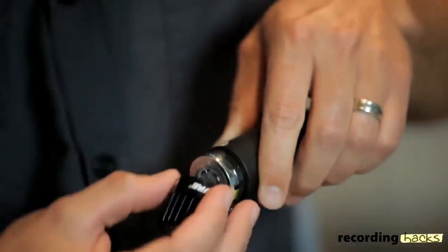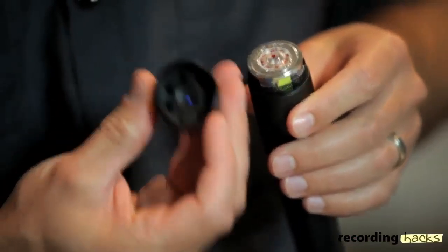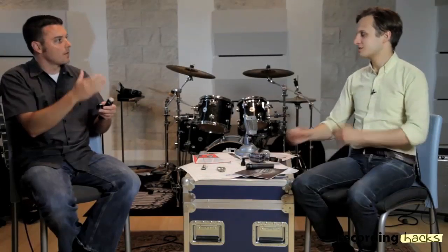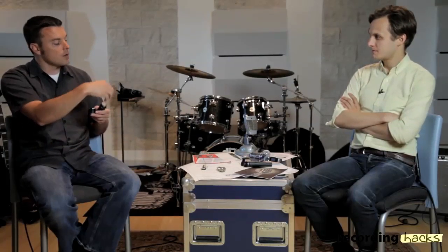Okay. Very high frequency, but as the microphone's natural response starts trailing off, we create a volume of air above it that's tuned to a specific resonance that boosts a frequency. Kind of picks up where the microphone starts trailing off. Interesting. And the more air you have above there, or the bigger holes you have, create a lower frequency, or the smaller the air volume, or the smaller the holes in the resonator cap, create a higher frequency peak. Interesting. So that's used to help extend the response of the microphone too.